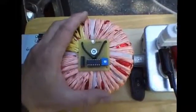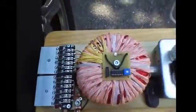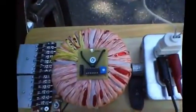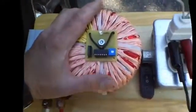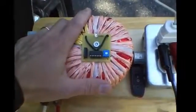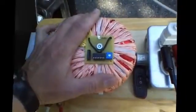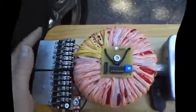What I wanted to show you is the power capability of this thing. I can light up some lights — 500 watts each, halogen bulbs — up to 2,000 watts of power coming off of this little toroid core. It's only supposed to be rated for 300 watts, but what I'm doing is just saturating the core with an incredible magnetic flux with these transistors.